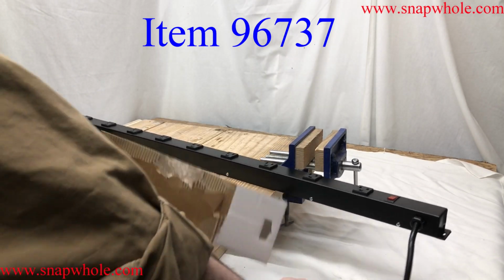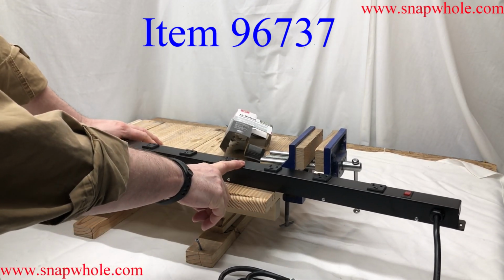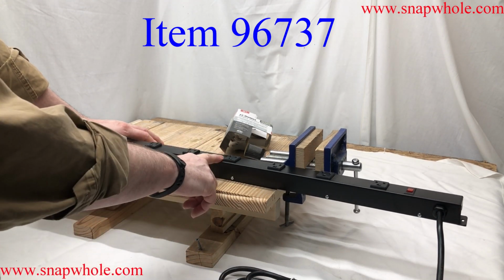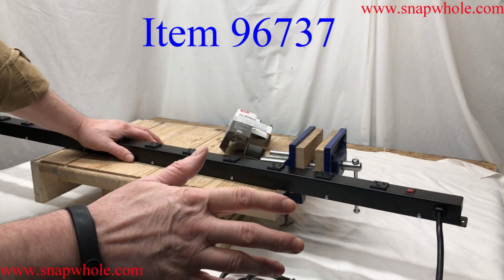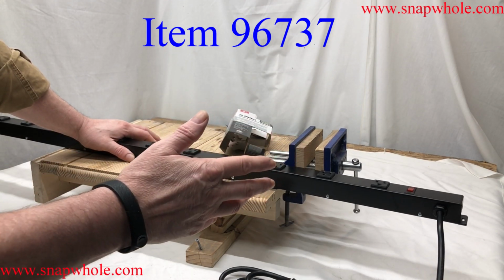Well, this is computer grade. I don't know if I'd call it equipment grade. I'd want 20 amps if I was using this in the shop. Most of the stuff I have here is 20 or 30 amps. But this is only 15. For that server stack, it's going to work fine. Most of the stuff goes into a couple different power strips into different outlets, but they're all in the same circuit. So I feel confident this will work okay.